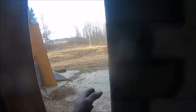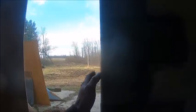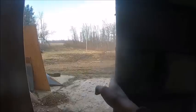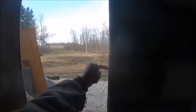And apparently their mold for these blocks is off slightly, because it's not every block, but some of these blocks are kind of running at an angle like this. But if you lay a level across the top, the blocks are level. And if you lay a level up here, they're touching here, and they're touching on the tops. So it's like the blocks are tipped that way, which I guess I could have made up for if I'd have tilted the blocks that way. But then, I don't know. The blocks aren't quite square. So like I say, if you lay a level across the top, they're level. But if you lay a level across three blocks out here, they're only touching on the tops, but you really can't tell.